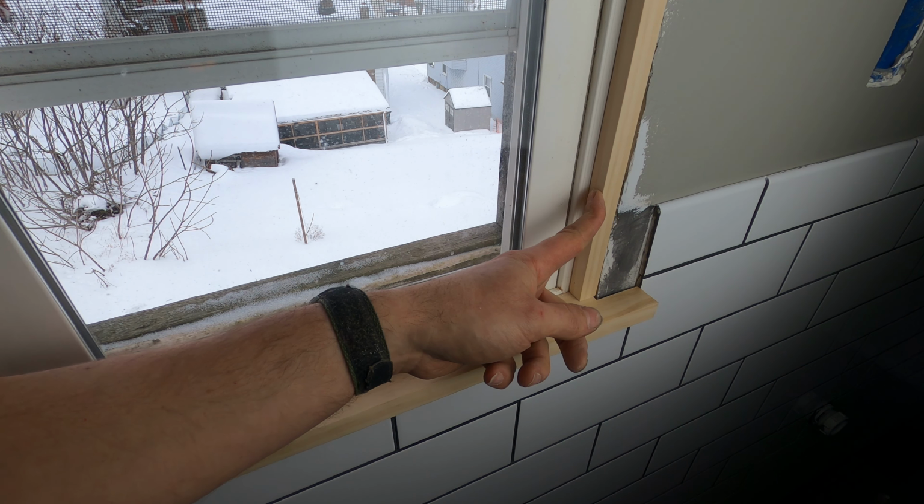But if I don't have a good color match and I can't get the right color from the store and I can't blend a few of these together to make the right color, then I put it on before the stain. Now, this stuff does not absorb stain. It's just how it is. But if it's a small enough hole, like a nail hole, then the stain acts more like paint and it goes right over the putty and it blends everything all right together.